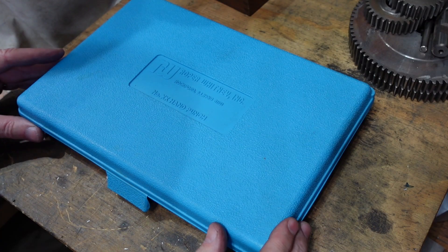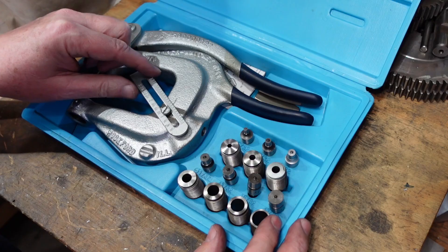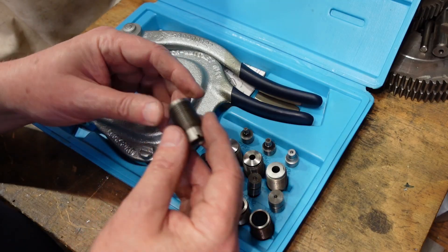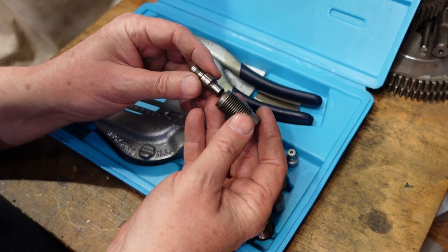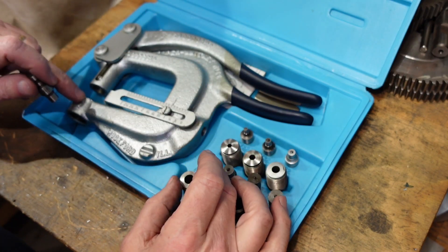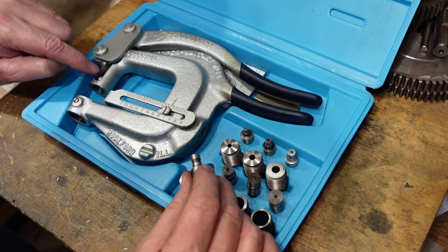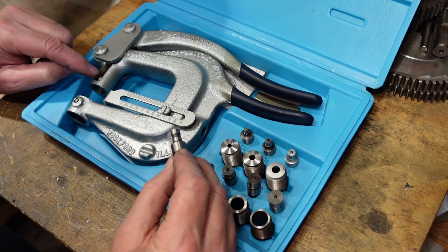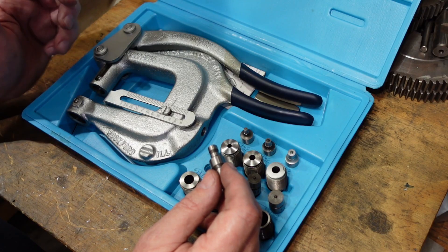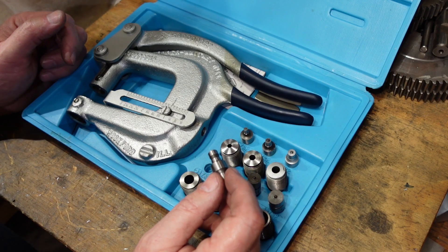This is the XX hand punch — as you can see, considerably bigger. I discovered when I moved the guide that they assemble these and then paint them, which is a bit odd, but it is what it is. The XX punch has a similar arrangement with a die piece and a punch: the die piece screws into the body and the punch screws into the top. It's got a couple of screws there — one retains the punch, but it also means you can fit square punches and things like that, special order, so you can actually punch square holes, which is something I'd like to do soon too.